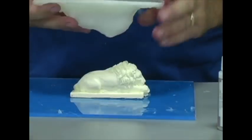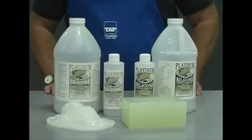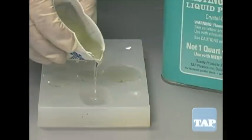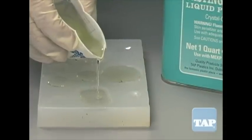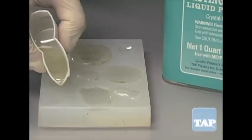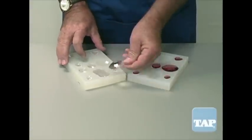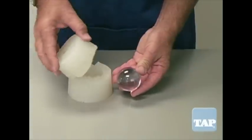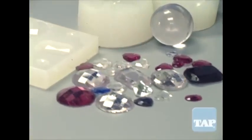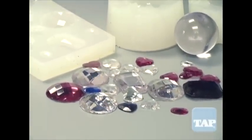You can also make brush-on molds with Tap Platinum Silicone. The advantage of a brush-on mold over a block mold is that it uses less than half the material, thereby reducing your cost by over 50%. One final feature: in a Platinum mold, clear polyester resin such as Clearlight Casting Resin cures without the tackiness and alligatoring common to other rubber molds. Parts come out with beautiful finishes — even small volume parts such as jewels cure with a gem-like finish, making Platinum Silicone the product of choice for clear castings.